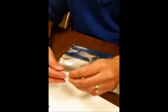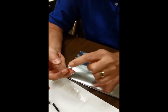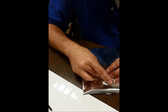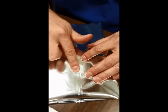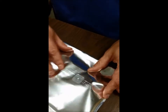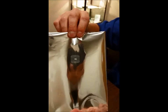I've got a hole in the bag. I peel my valve off the release liner, being careful not to contaminate the adhesive layer. There are oils in your skin that can transfer into the adhesive layer, and you certainly don't want to touch that. I take my valve, apply it over the hole, and then simply apply some pressure. Then pull the silicone pad out and now I have a bag that has a pre-applied valve on it.